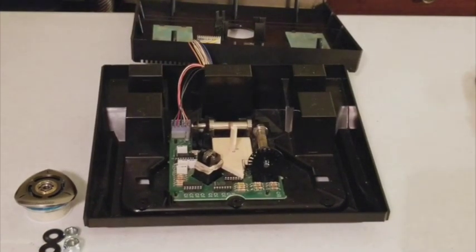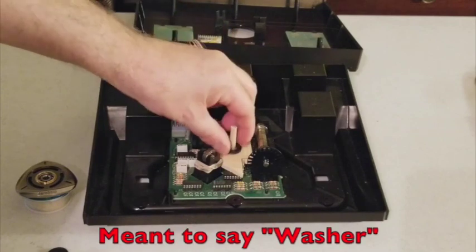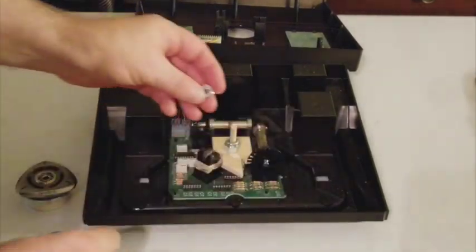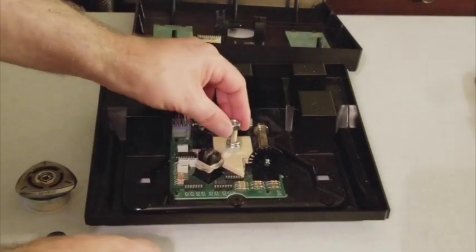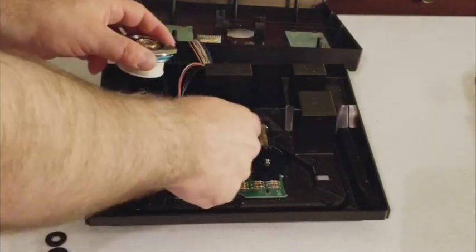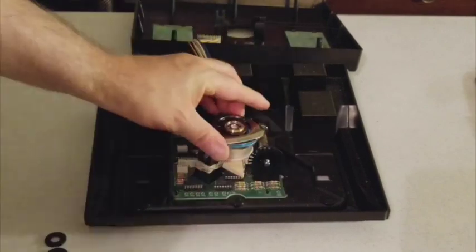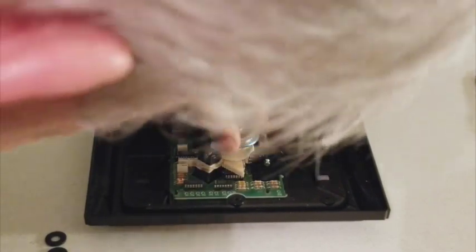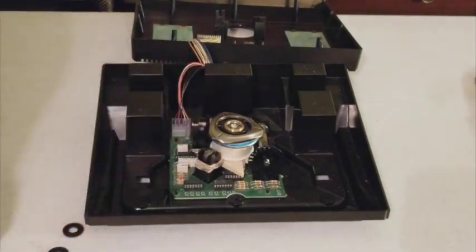Okay, so we've got the 5200 Trakball ready to roll here in a minute. One thought is you might want to put a bearing down here to add some thickness. I'm thinking we don't need that, but that's a backup plan. We've got a couple of nuts to put on, one small one that fits pretty tight, and one that's a looser fit, but that doesn't matter. We're trying to get the height proper so that when this is mounted, the bottom of this bearing will be up against that. If we didn't have those in there, this is going to go too low and end up bumping against the wood. As it stands, I don't think we've got contact with the wood, and if we do, then we may want to raise it a little higher by adding a washer. Let me check it.